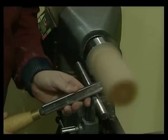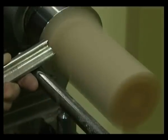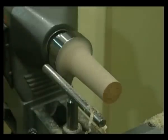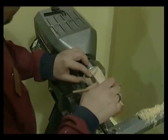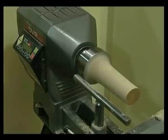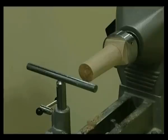Using a roughing gouge, turn the outside of the wood down to the round. Switch the lathe off to ensure the entire square has been removed and you have a round piece of wood. Now mark an inch and an eighth or 28mm from the end for final parting, to give clearance for the screw chuck. Mark with a pencil line while the lathe is rotating. Now put the tool rest in the safe tool rest position.